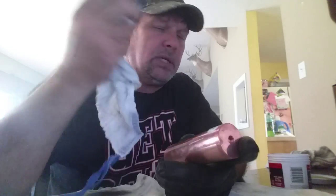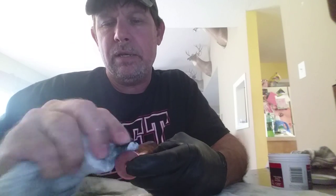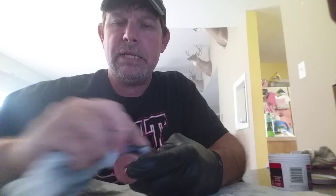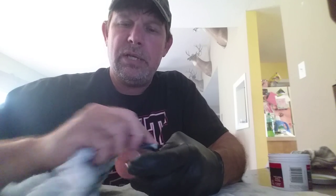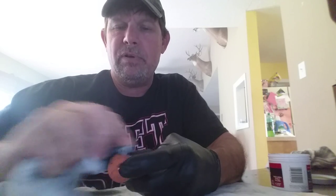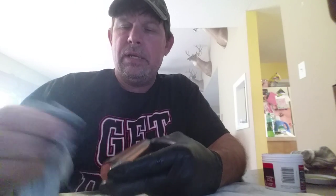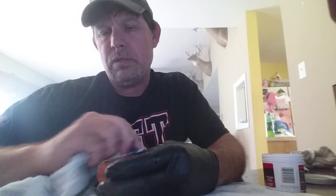So what I do is I get a little water rag between my fingers, dip it down in here, and I just start applying. And I just rub. I try to stay in the same spot for 8, 10, 12 seconds. You can tell when the patina starts wearing off, you'll start seeing a real black. It starts turning black on you. I like to rub it till it starts turning really black. Then I'll rotate my mod and put a little more polish on my rag. I try to use that same spot of polish on there. That way it kind of forms to your mod. Just rub it.